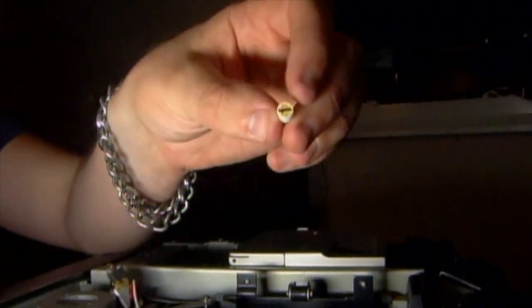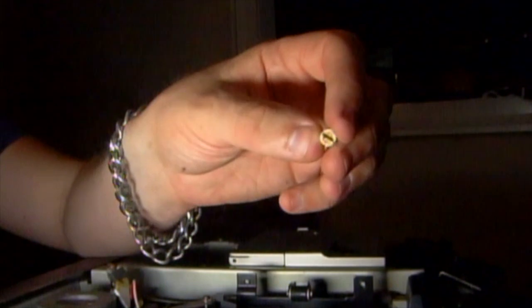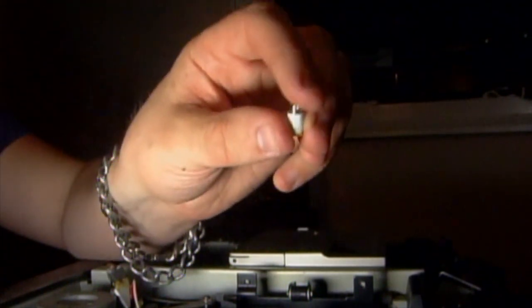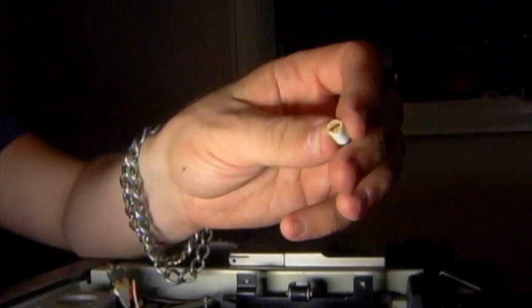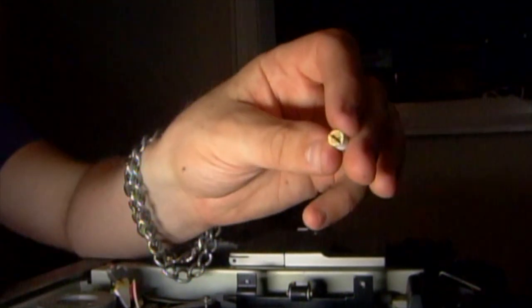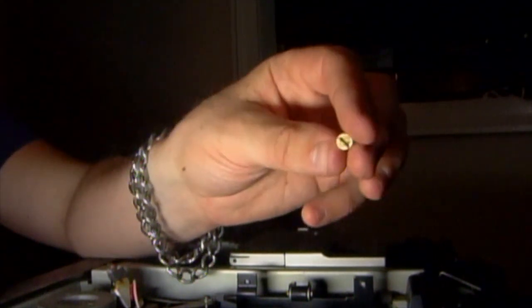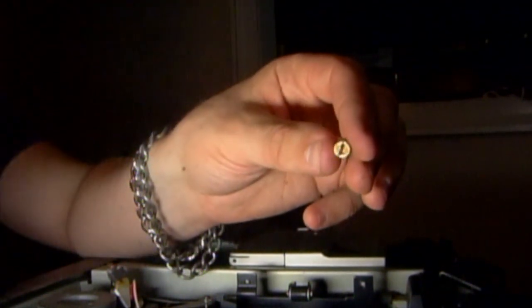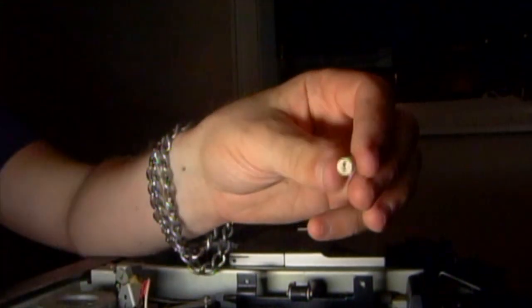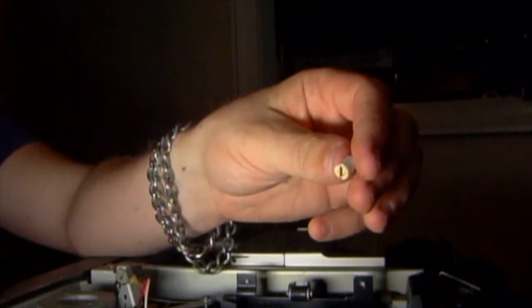So this is the light. I don't know if you can see it on there, but it's a little rusty under there, which is probably what made it have a bad connection. That's probably also glue too, but you could actually see where the two metal prongs that stick through here that get soldered on to the actual chip were rusty. So yeah, let's get a new light bulb, which I have here. I will show you.